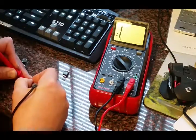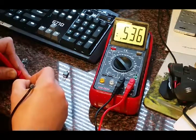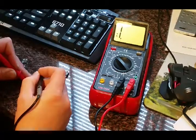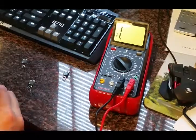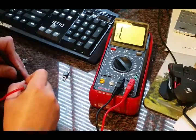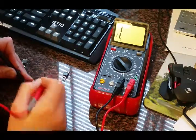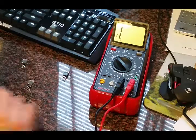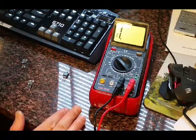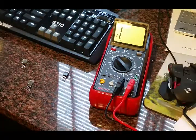The right leg is an open. The center leg is good, but the transistor is bad. We'll turn this around to confirm — testing that center leg, we get nothing as we should, and we get nothing on the other leg as well. So that proves that this has been burned up as a direct open circuit, therefore ineffective at doing its job.